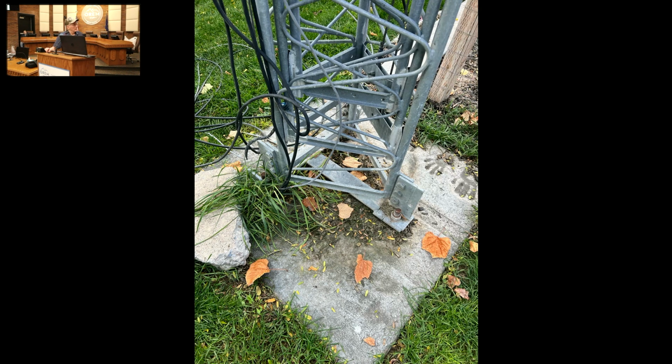But if you look at the base of it there, it's kind of a triangle layout on the bottom. You can see that bolt sticking up that's alone there. What happens is you can crank it down by taking the three bolts loose and the two bolts on the top of the other, and then you can just lay the tower down after it's cranked down. And I've got a thing that you can crank it down and undo that if you have to. But the idea is, you've got to be responsible for providing your own manpower and hauling it off the property.